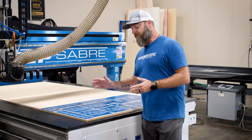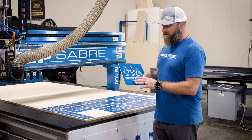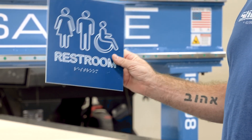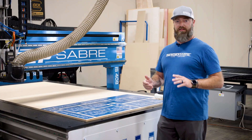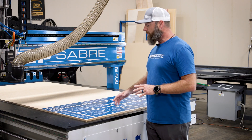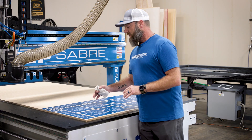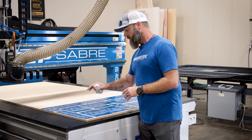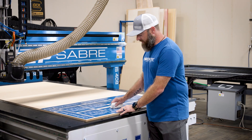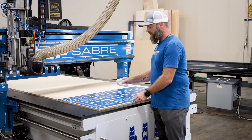All right, we got everything cut and I'm really happy with the way it turned out. The Braille printer from Quill puts the resin down, and as it went along the UV light cures it really well — it's really hard, it would take a lot of effort to pick something like this off. Everything just turned out fantastic. We had some parts that we did two passes — one conventional, one climb cut — because cutting plastic, once in a while you're going to get parts that may melt into it or stick a little bit. The ones we did in two passes turned out just perfect. The ones done in one pass, if I take a soft cloth and kind of wipe them off, you can see a little bit of fuzzies come out of there.